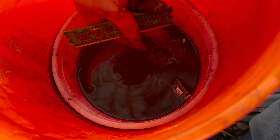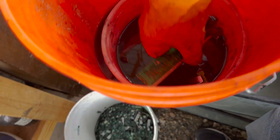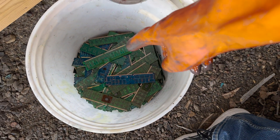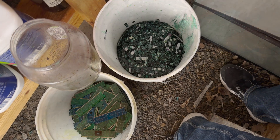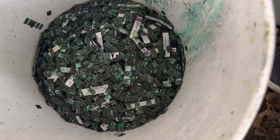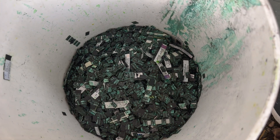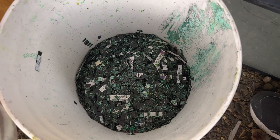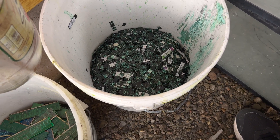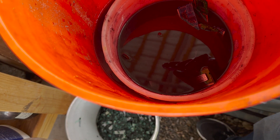When I have the board free of all the big stuff, I'll put it down in this bin, which will go through another batch of acid — but this time it'll have a bubbler and it'll take the fingers off. Then I'll rinse off. You can see there's a ton of copper in here, copper and still some chlorine, some chloride. I weighed the bucket yesterday — it's 13 pounds, but that includes the bucket weight. The bucket is about a pound or two, probably closer to two, which puts that above 10 pounds of chips.